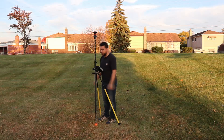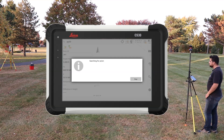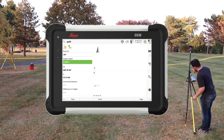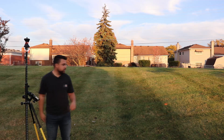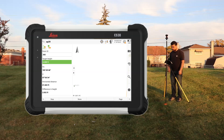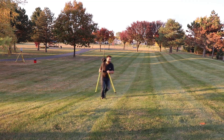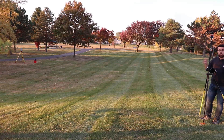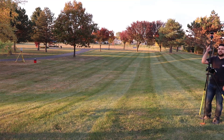I'm actually going to use a bipod just to really ensure that the bubble is in the center and that our rod is plumb. I'm going to go ahead and make the total station search for me. Lock to target — we're plumb on this point, I'm at 6 feet, everything looks good, and I'll hit Store. Point stored. Let's go ahead and take our pole and head over to the next point. Everything looks good and we'll store this point. Point stored. Now we'll pick up our pole and go to the last point. We will store. Point stored. We've got all three of those points stored. Now let's get rid of the bipods and add our AP20.